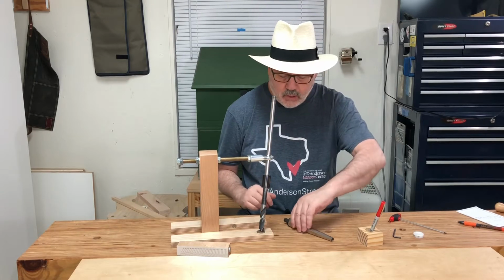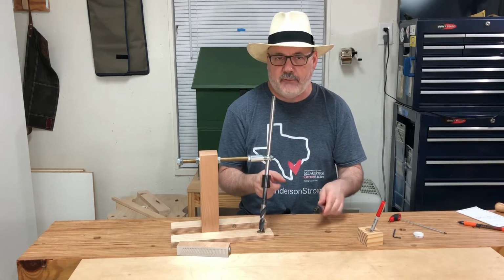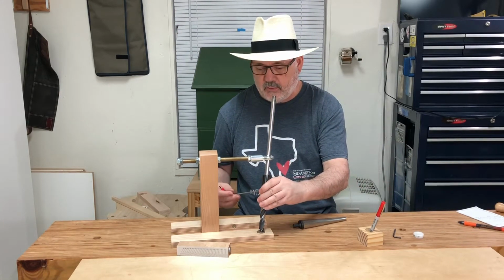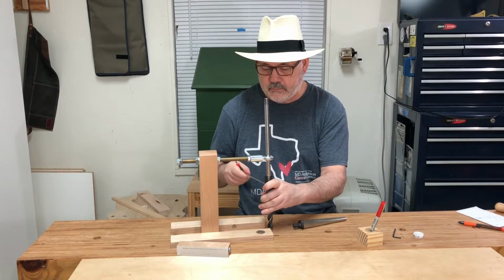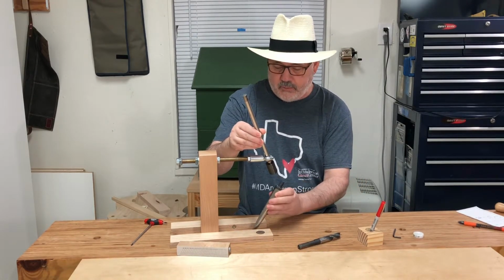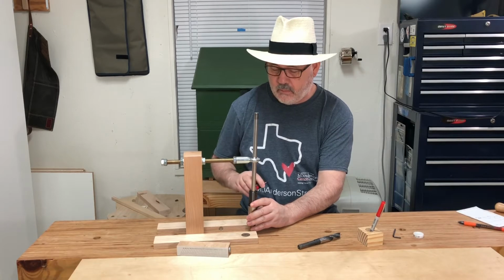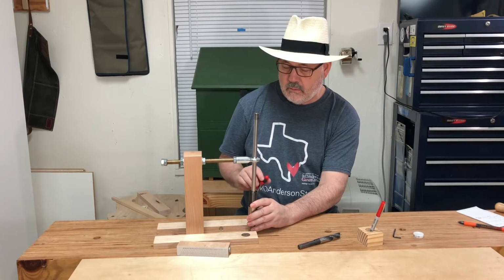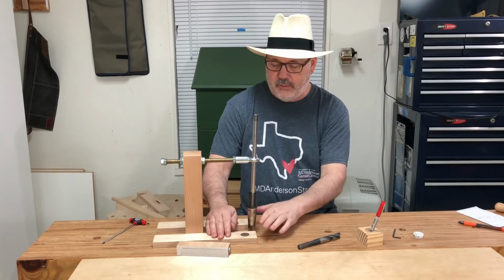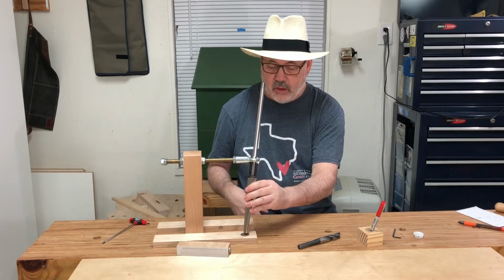So how does this work? Well, the reamer comes with a 7/16 inch hex shank, which works perfectly in the 1/2 inch coupler that I have here. So at first you would drill your leg mortise, and then you would simply exchange the drill bit for the reamer to then ream your hole. So let me put this in this dog hole here. That lined up, and cinched down. So basically you have your jig in place clamped. There'll be demos here in a second so you can see how this works. And then you simply replace your drill bit with the reamer and then ream away.